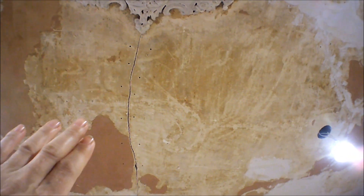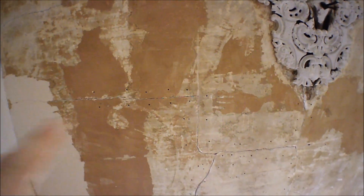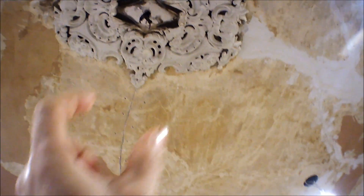You can see all my little cracks — I started putting screws to reinforce them. If they're a little loose you put screws on both sides. I got most of that done, just got that one crack to do. After you screw them in, I score them with a razor blade so the crack is real deep, so when you put in your mud it will actually go in there. If you leave the crack real small, no mud is going to go in it — it's good to score it really well. Then after I fill it with mud a little bit, I'll go get some fiber tape and run it over that. I filled that one, so now I'm going to put some fiber tape over those cracks I already filled.